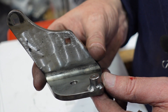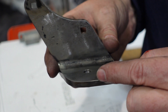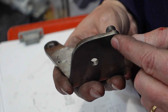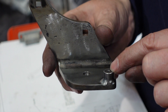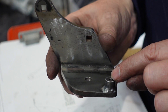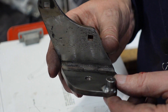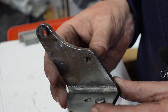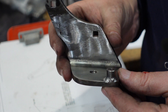There it is - the bracket for the quadrant banjo, whatever you want to call it, to swing on, complete with my bush that I've welded on. I did that by tapping the bush M3, then with the diameter 3 hole put a screw through, welded it up, and later I'll drill that out for a dowel. I'm going to leave that for the moment just in case I want to spot through onto the other part to check my position. So there's another major part - a rather complicated looking one when you look at it, but actually quite simple to make. Thanks for watching and we'll see you for the next one.